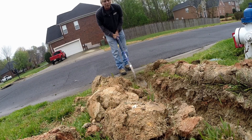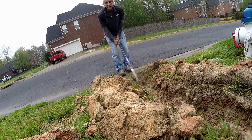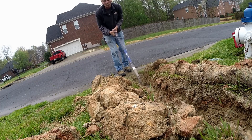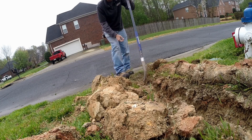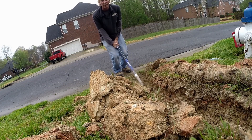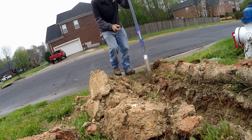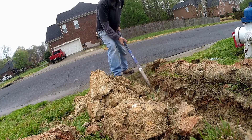After you take out a good shovel full, working backwards, go back through the trench and clean the bottom of it. Just use your body weight, push the shovel against you, shove it through, lift it up, and dump out the soil. This makes a very clean trench and you'll be at the right depth to install your pipe.